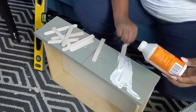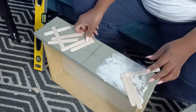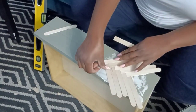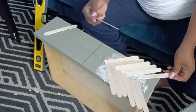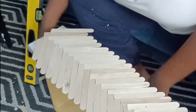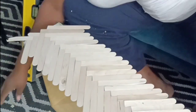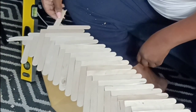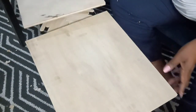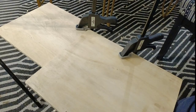Next I went in with some wood glue — I'm using Gorilla Glue as always, I love their products. I did try to avoid doing the herringbone pattern because that is the really popular pattern I see when other people use this method, and I always try to make my stuff a little bit different. But no matter how I laid these, I played with it off camera and it still ended up kind of looking like a herringbone. So each drawer is unique — the patterns are slightly different because I was trying to think of ways to make my stuff unique. You will see an intentional difference in the two drawer fronts. The water and wood glue will make the sticks bow if you don't clamp them quickly and put something heavy on top, so that was my next step.